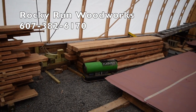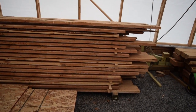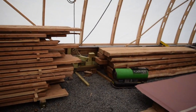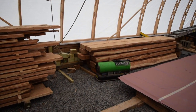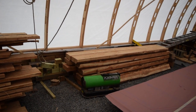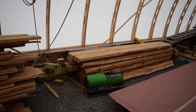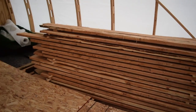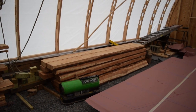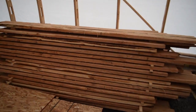He's just starting out — nice young guy in upstate New York. I'll try to put a link to his contact information. He sells white pine, larch, and something else I can't remember. I ordered 1,100 board feet but this is probably 1,250 because of the extras he threw in. It's still green — my moisture meter reads over 20% — but it does burn without foaming on the ends, so it's pretty dry. In a month or two it should be within parameters; for boat building you don't need furniture-dry — 16–18% is fine, and the glue instructions confirm that too.